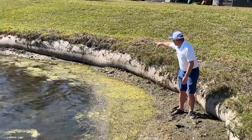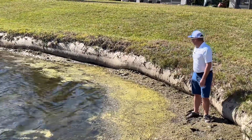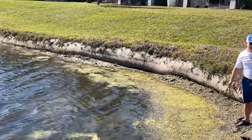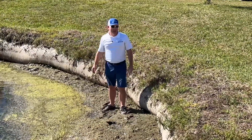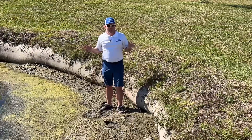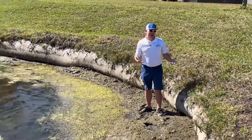Over here you're probably at about a three to four foot escarpment, which is way out of compliance and it's also affecting the slope. The slope is also out of compliance. A lot of our competitors still do this geotube because that's all they know how to do, and we don't. We don't offer it, and this is why I like to show what eventually happens when you have a geotube installed.